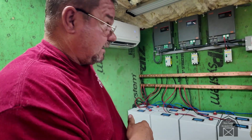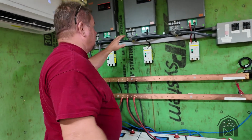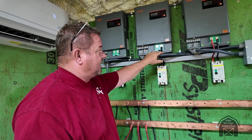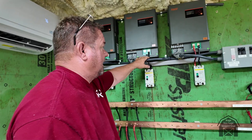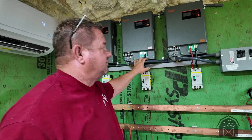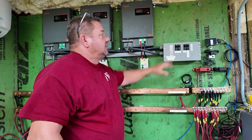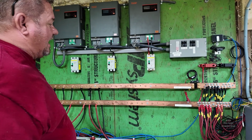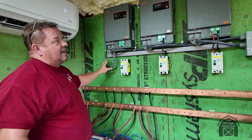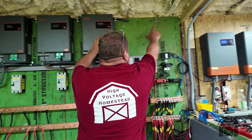That's all right, I like it. Today I just started getting these three ready to do the barn — got the circuit breakers mounted up. I started making jumpers until I found out I was out of wire, so I had to order some more. I did get all the high voltage side wired into the next panel box so we can take the feed out.